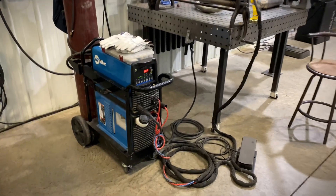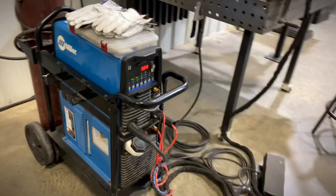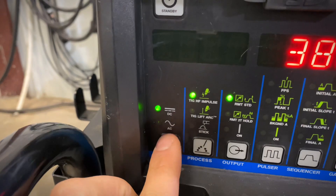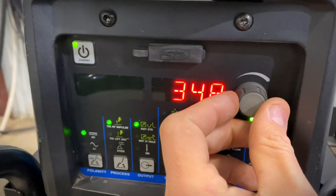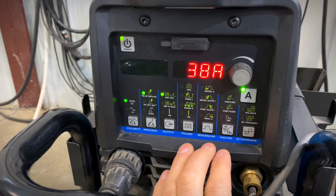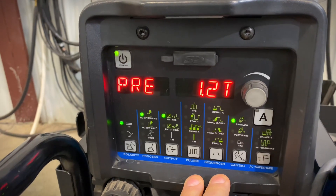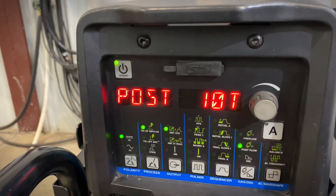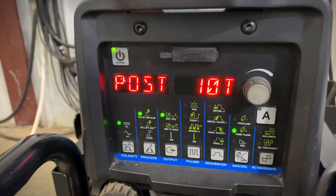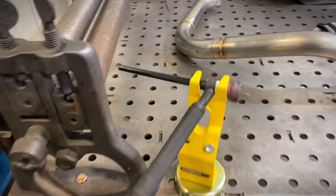As you can see, this is one of our welding stations. We use Miller Dynasty products — they are great welders and have worked really great for us. Since we're welding stainless steel, we want to be on DC. I like to be at 38 amps exactly for this thin material. We're going to set our pre-flow to 1.2 — you want gas flowing out of the nozzle before you strike the arc to keep the electrode clean. We're going to set our post-flow to 10 seconds; that's the gas flowing out of the nozzle after you release the pedal, and you want that gas flowing to keep the molten weld clean, shielded, and free from contaminants.